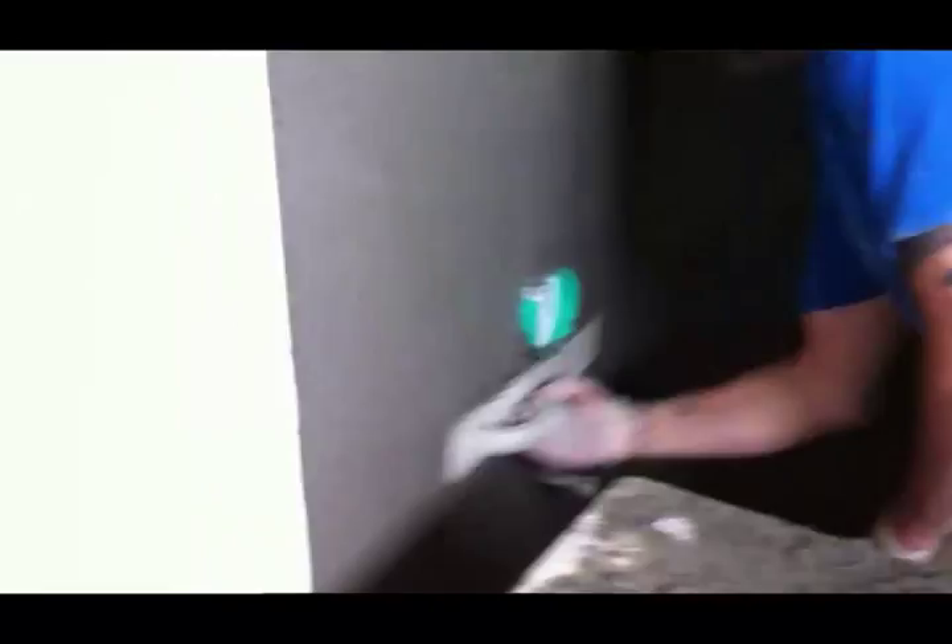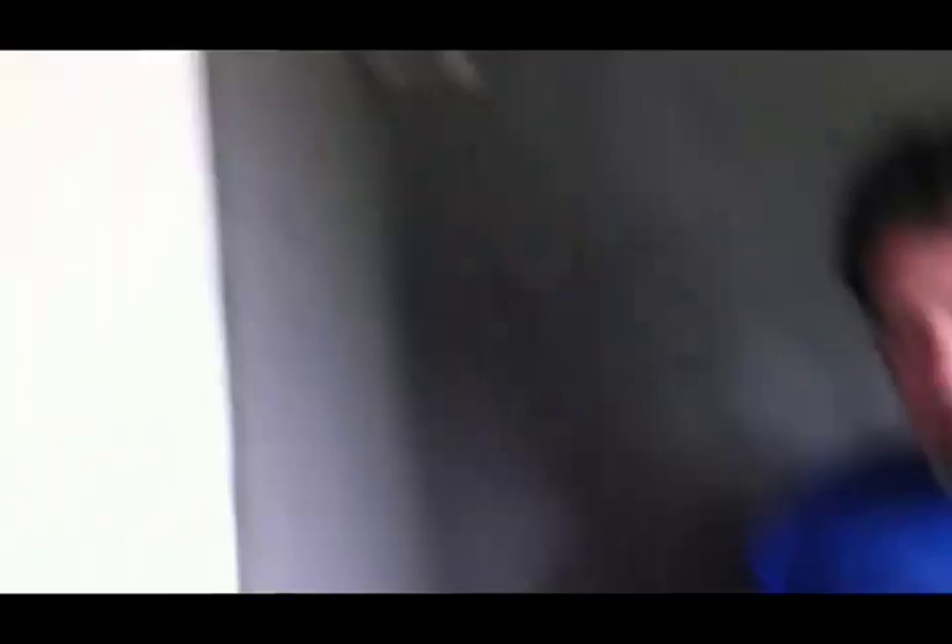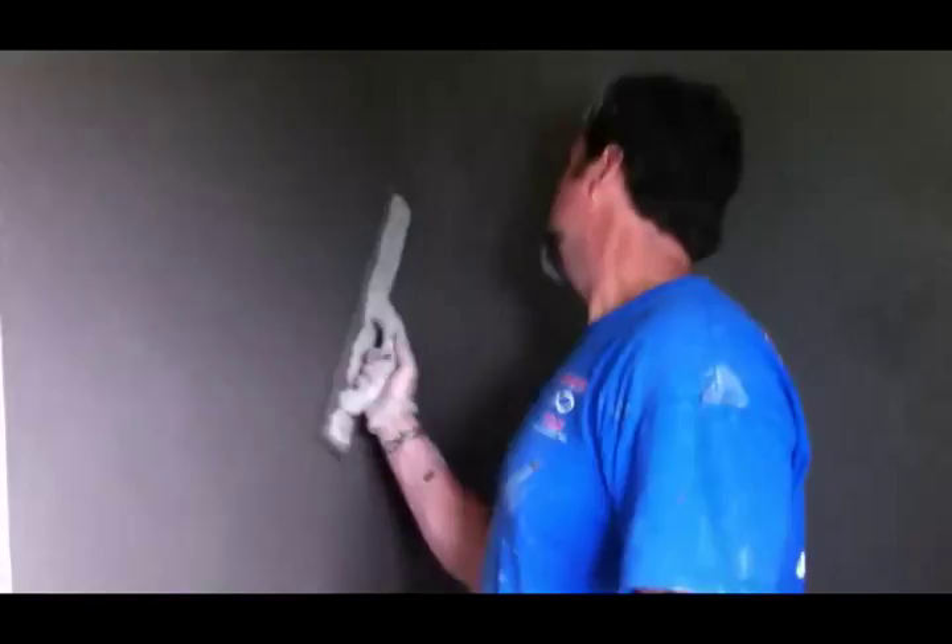Let the mud sit up a little before you do this. Use two hands if you have to go up. Rod it off so you don't have any bumps, and then go along the top. Use your wood float to really flatten it out and smooth it — just go along any bumps, knock them down. Make a nice smooth flat finish for tile. Then really go around these plumbing fixtures because you don't want any humps when you set the tile.